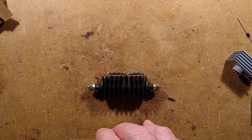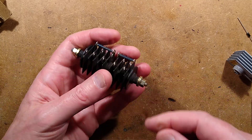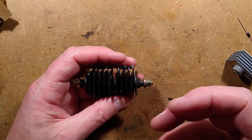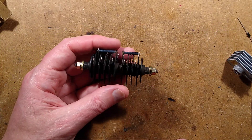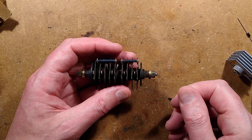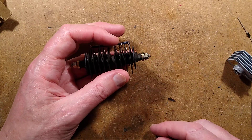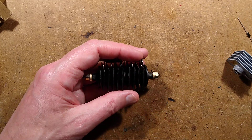The smoke coming off is fine particulate selenium dioxide, and it stinks. The common description online is rotting eggs — I wouldn't call it rotting eggs; there is a certain eggy component, but it's a nasty, sickly, vile smell. So you don't have to worry too much about breathing it because you wouldn't want to anyway. I've had one go bang while I was working in a panel — I stuck a fuse in, that's why the fuse had blown — and it stank the whole control room out. As soon as that happens, the first thing you want to do is get out of the area, not because it's harmful, but because the smell is so bad.